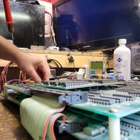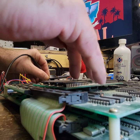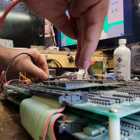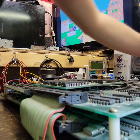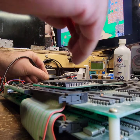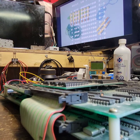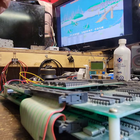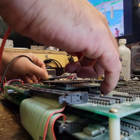Let's do minus five. Let's turn it back on. We were getting 4.2, now we're getting nothing up here. Let's turn that up. We're gonna be nowhere near spec. 4.5? I doubt it. I noticed I went into reset — that's fine. Let's check that one more time. I literally just cranked my power supply. Yeah, 4.532. That's not gonna be enough to run it for sure. It should be nothing under 4.9. 4.529.